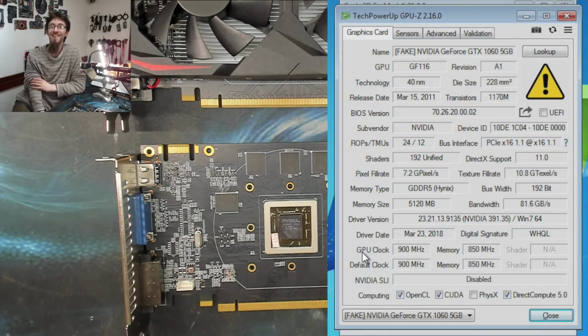Yeah, it's a complete mess, but it's interesting to see that, because looking at the specs for the GeForce GT 545, which was, as far as I'm aware, the higher performance version that this core came in, even there it's listing lower specifications than we're getting out of it. Yeah, and it's listing lower maximum bandwidths and things like that. But interestingly, lower core clocks. It's listed as a core clock of only 720, whereas this has a core clock of 900. So interestingly, if you have one of these, it might actually overclock reasonably well by percentage, but the actual performance you'll get out of it will be awful.